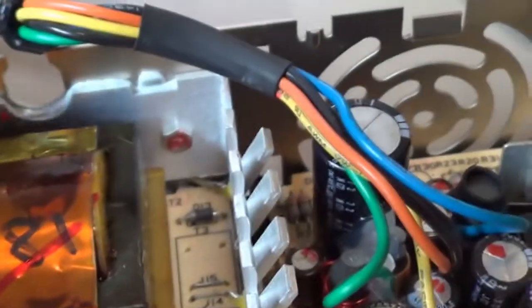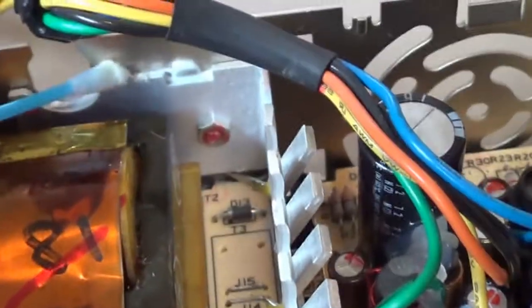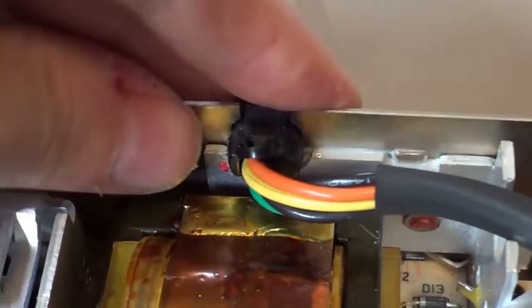Make sure you get your 2 screws back on your heat sink on the back side here. And if you got a little carried away with the thermal compound, go ahead and wipe that up so it ain't getting all over the place. Clean it up. And of course, pop your wire thingy-majiggy back in here. These can be a finicky little booger, but take your time, needle those pliers, just squeeze them back in and pop them back in. And we can pop the cover on and 2 screws, and I guess we can give it a test run.